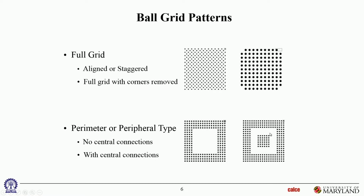Right. Whatever the pin grid or the ball grid placement you do, it is tilted by 45 degrees. If you see the outside world, it is a balls-anywhere concept. It can be at 45 degrees. So here, what are the stresses? As sir told, it is like the die shadow. So wherever the shadow of the die is, those pins will be affected, whatever you tilt.